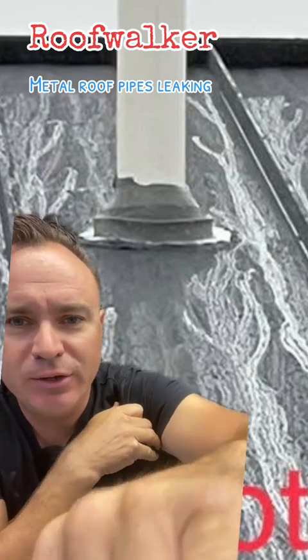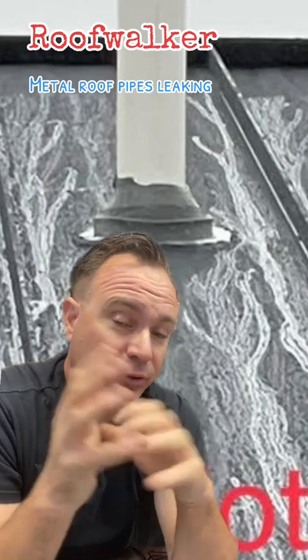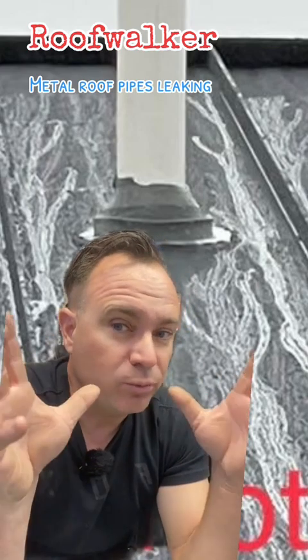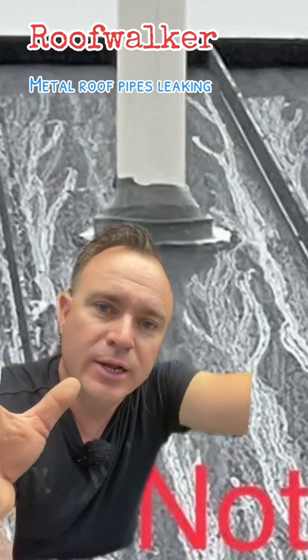What's interesting is I also see — typically you put these in and then you put screws all the way around this flashing. I don't see any of the screws; maybe there's one or two there, but typically there's a lot. So the good news is if there's no screws, you could probably pull this off. These come in different sizes — I would find one that's a little bit bigger that will still accommodate the pipe size. That way it'll cover this area where you peel this off, so you don't see any of the leftover silicone.